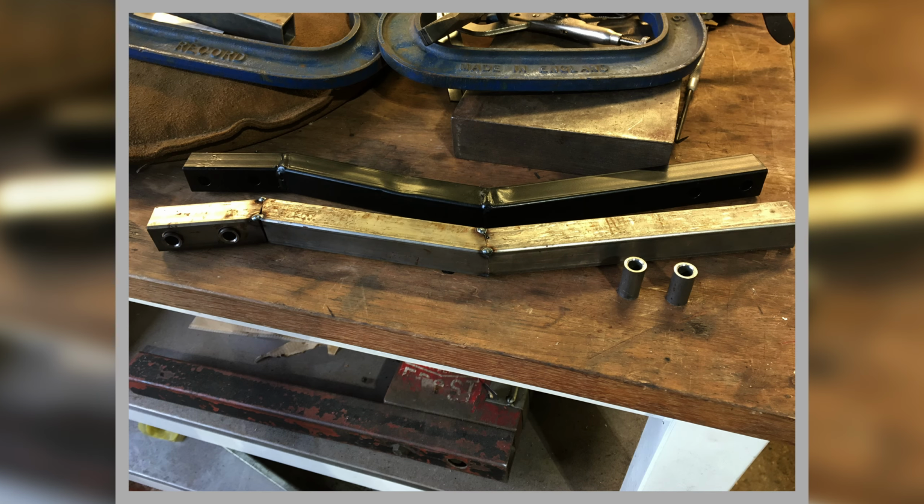Now we're on to these rear stay supports that go under the back axle, which tie the chassis to the back of the car, a sort of strengthener. Early cars didn't have them, I've been informed recently, but all the stuff I'm working on does, and ours should have it. The one with a kink in it is off the Maserati Coupe, so although it's painted, it shouldn't be at this stage because we had to straighten it, but that's a different story. That's why mine's a different angle, because I'm doing mine without that kink in it.